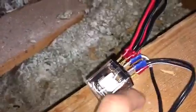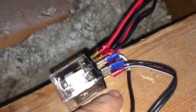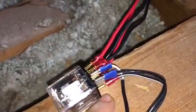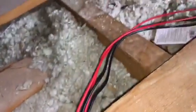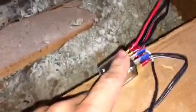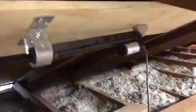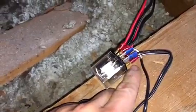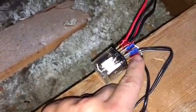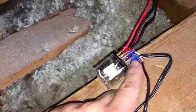Now that is what you plug your simulated 12-volt trigger into. That's what triggers the relay switch. And what the relay switch does is it just changes the polarity, which means it changes the direction, up or down, of the actuator. These 2 are not always receiving power. It's just a trigger, these bottom 2. They call that the coil.